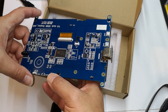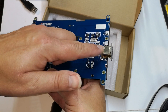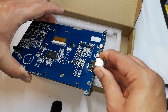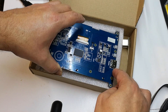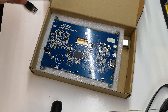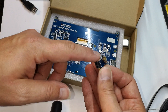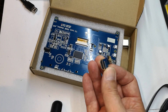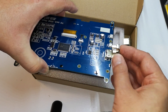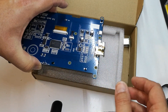The only problem I have with it is it's described for use with the Raspberry Pi 3 and the Raspberry Pi 4, but clearly this full size HDMI connector is no good for the Raspberry Pi 4. So I did a quick Google online and bought this little alternative which is a standard HDMI to - I can't remember now whether this is called a mini or a micro - HDMI connector, but it fits the Raspberry Pi 4. So I'm hoping that's going to plug in there and we can attach the Raspberry Pi 4 onto there and that this should line up with the HDMI port.